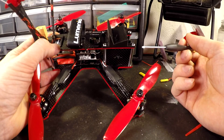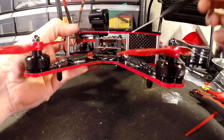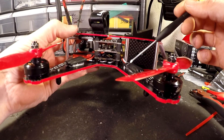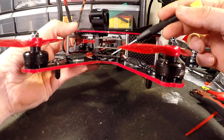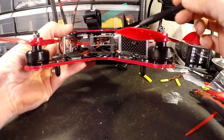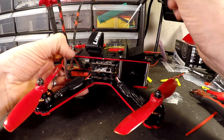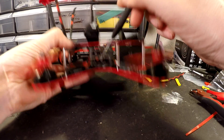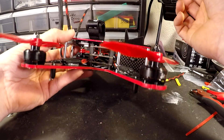For the power and ground and signal wires coming off these ESCs, instead of replacing them like I usually do, I just cut them down to size and ran the power and ground where they needed to go, soldered them into place — same thing for the signal and ground. The way the Naze is set up on this build, the signal and ground connections are all on the front. So for the two ESCs on the front I just measured and cut them to size. The ESCs on the back I fed underneath my power distribution board and brought them up to the front to solder into place.